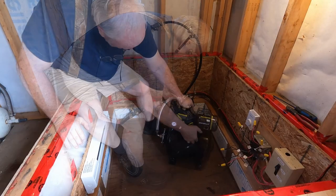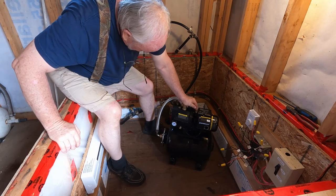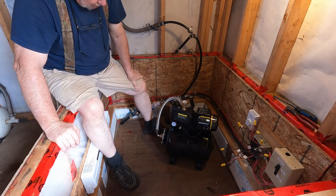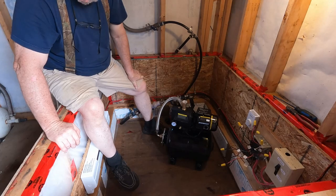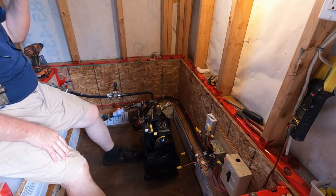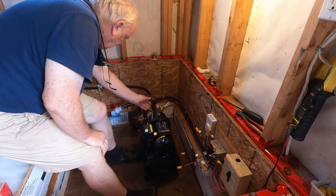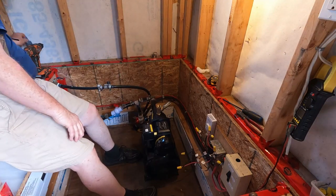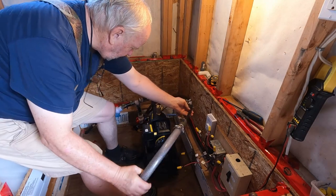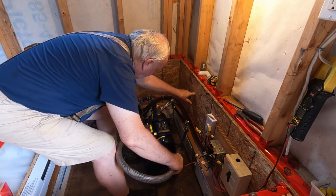All right, this is my new pump. It's a half horsepower shallow well jet pump. It's got about a five liter pressure tank on it. The pressure tank is pressurized with 25 psi of air and there's a bladder in it. The idea of a pressure tank like that is it gives you more of a drawdown before the pump will start — it doesn't give you more water but it gives you more of a drawdown before the pump starts. I think I've figured out where I'm going to locate the pump — approximately right here. I have to put a new piece of line on here. This is the suction line and that'll couple up to the pump right here and I have an adapter for that. The outlet of the pump comes out here — so this is the supply line, the outlet of the pump. I have a fitting here that's going to go to an outside tap, so that'll go on there.